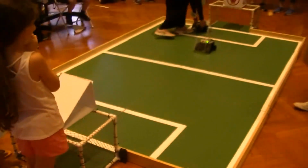That will give you the ability to say, if I'm printing this and I want to make this one, but I know I'm going to spray paint it gold, I don't care what color the plastic is going to be. I can print this, and I can use this object as the infill. So all that material that would go to waste, we would use to print for this. The infill. Yep. Excellent. So it helps reduce that amount of wasted material. Yep.